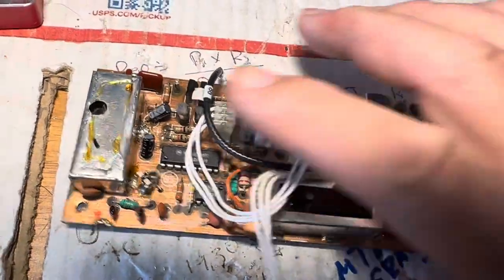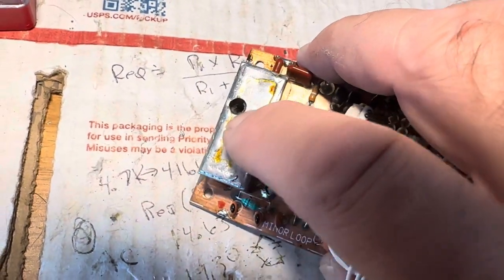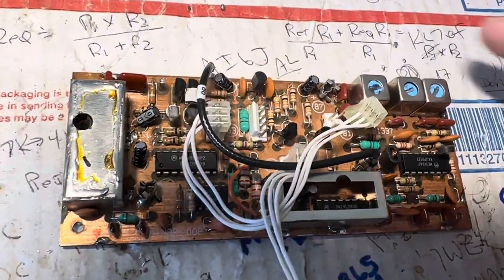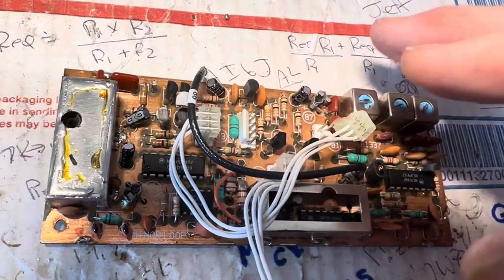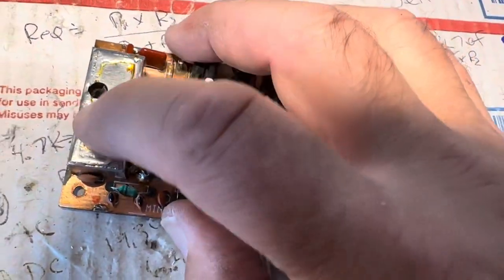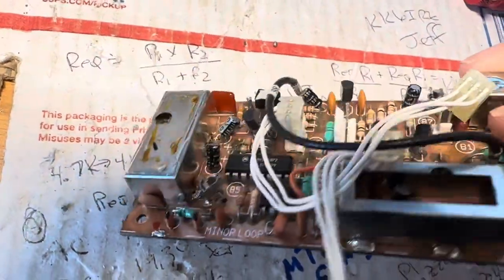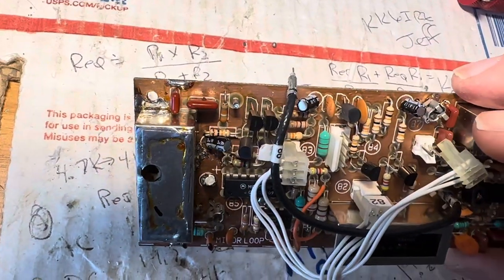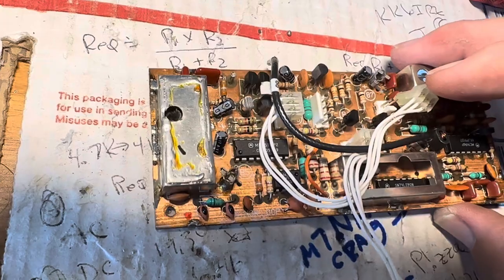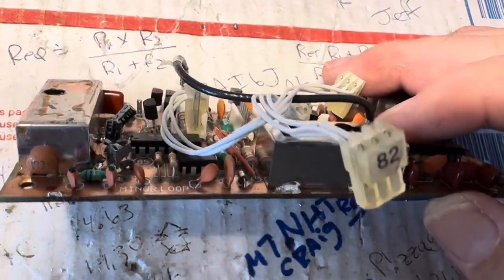This board has a wounded, or golden screwdriver-esque slug in this coil, which I may or may not be able to work with. My worry is that the gentleman who owned this radio and gave it the golden screwdriver may have damaged the coil in there. I attempted to take off this little lid here, and I haven't yet been able to get it off. I tried to desolder it the best I could and I still can't get it off. But I may not need to get it off.